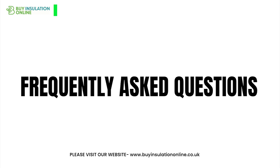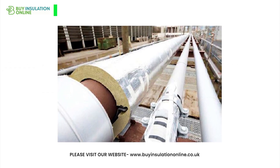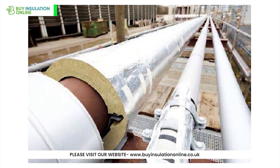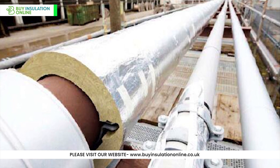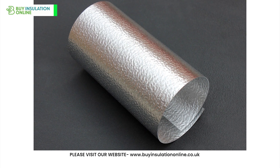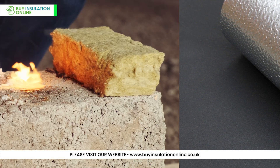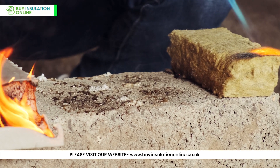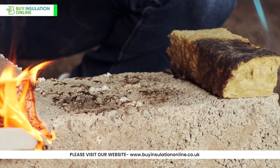Now let's address some frequently asked questions about Rockwool pipe insulation. Can you use Rockwool pipe insulation for outdoor pipes? Absolutely. Rockwool H&V pipe insulation is suitable for insulating pipes located outside buildings. However, it's crucial to protect the insulation from potential damage and extreme weather conditions by using appropriate pipe insulation cladding. You may consider using products like aluminium metal cladding, PIB insulation, or 5-ply laminate pipe jacketing systems such as Venture Clad or Proclad for this purpose. How long can Rocklap H&V pipe sections provide fire resistance? These sections have undergone rigorous testing and proven to provide up to 120 minutes of fire resistance, making them a reliable choice for enhancing fire safety.